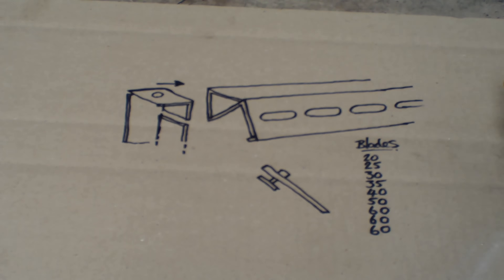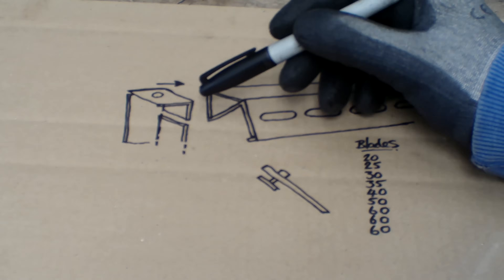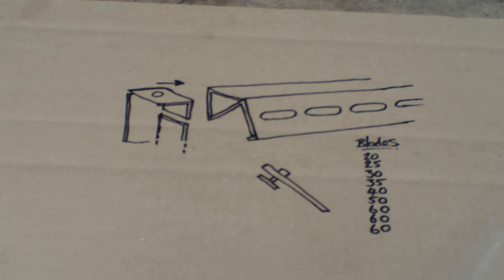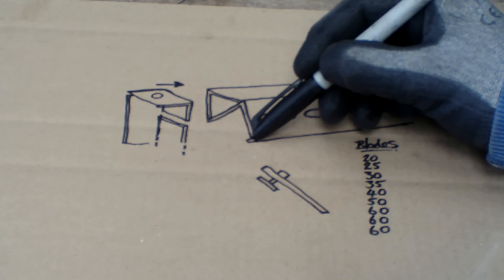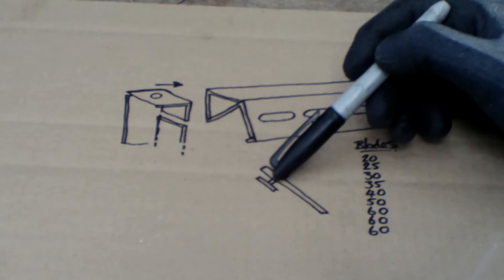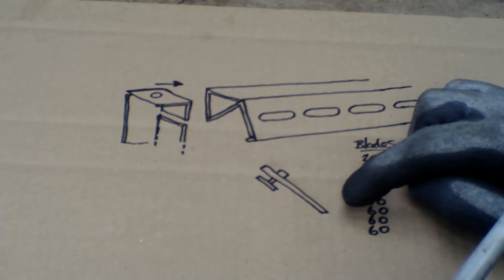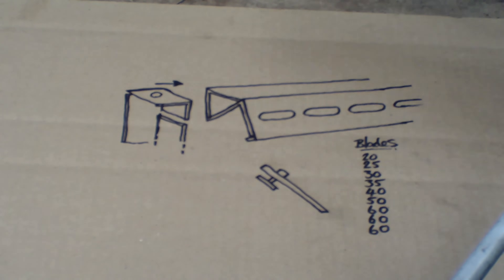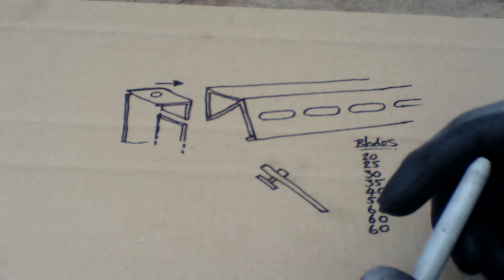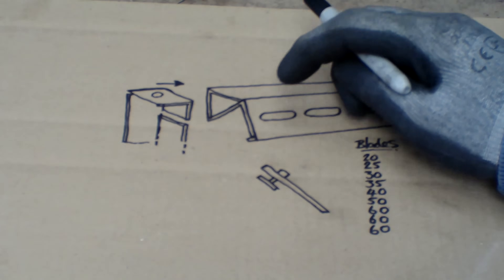On the end we're going to need to cap it with another piece of angle. I'll need to extend this down and it's going to be boxed in at the back as well — essentially it's a box on three corners with a hole in the top. On the inside I'm going to put a little lip to keep the blades captive. This is going to be one of the blades, made out of that thicker 8mm stuff. There'll be a 45 degree bevel on the end of it so as it's clamped down it grips up nicely with the material underneath. A bolt goes through with a captive plate on the back — the captive plate goes behind on the inside of the angle, the blade goes on the outside, and the bolt screws through to keep it all there.